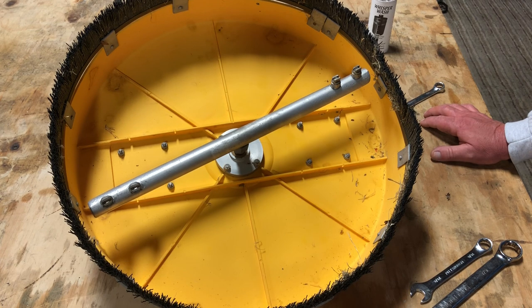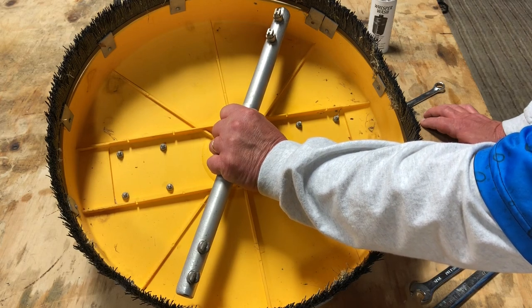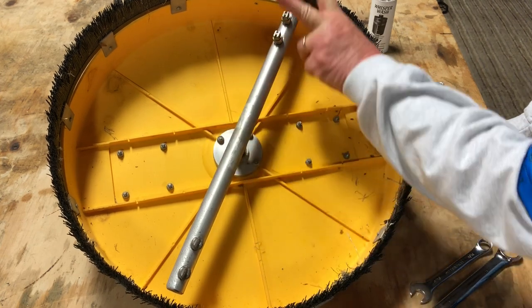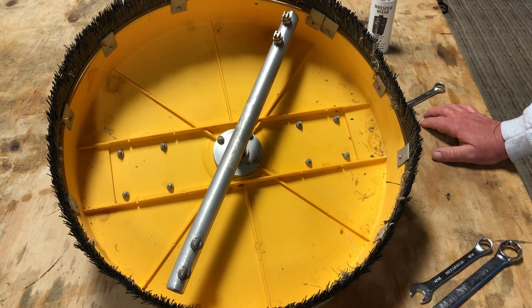The other thing you want to make sure you're doing is testing the nozzles before every use to make sure you don't have a clog. You don't want to get going and then have to stop and make a repair. So we always check them before we get going on every concrete cleaning job where we're using the surface cleaner. We basically flip it over, hold the bar, slightly release the ball valve or pull the trigger. We use the ball valve so we don't have full pressure coming out, and we'll slowly turn it and make sure the spray patterns are all equal — no clogs, nothing that's going to cause uneven cleaning.